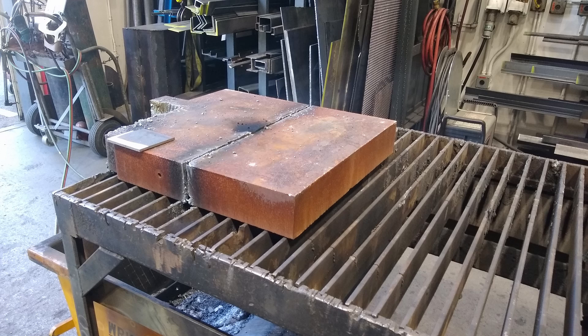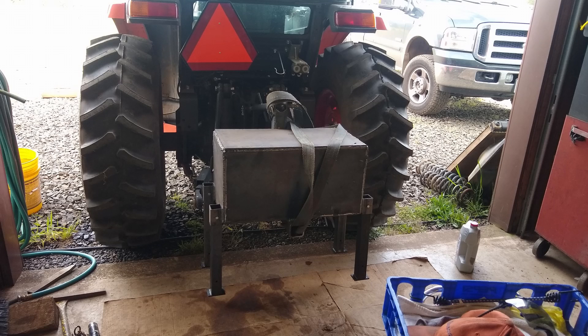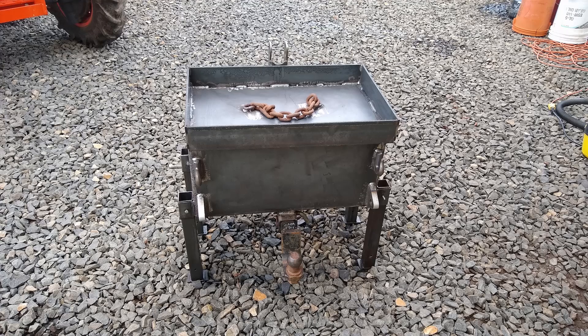Here's kind of an example of the material I put inside — big chunks of steel. This one here is about four inches thick and I had to cut it with an oxy-acetylene torch. I didn't have the correct size tip so it took a little while, but I got it done. The chunks of steel were packed in there kind of like Tetris, then tack welded in at decent intervals so the stuff didn't move around and added rigidity through the whole box.